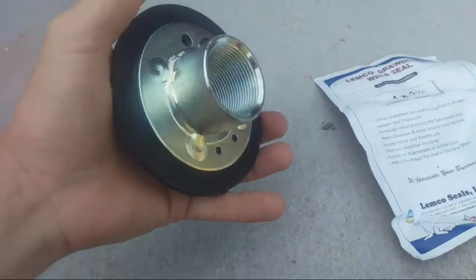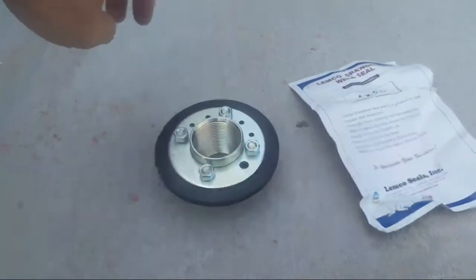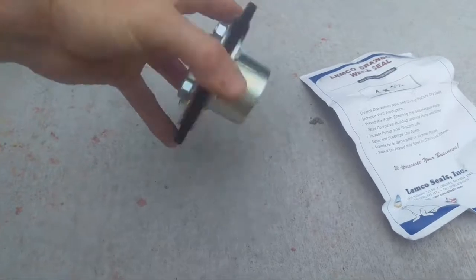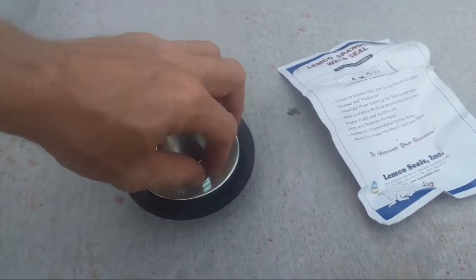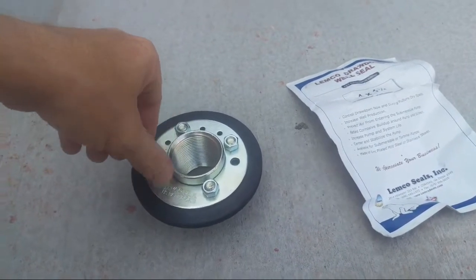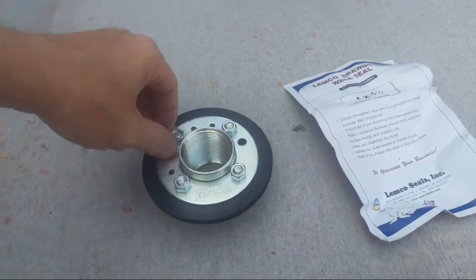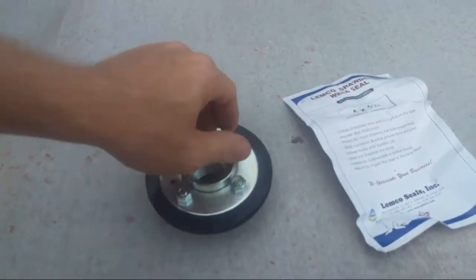But anyway, yeah, good luck with it, man, because they've worked for me in the past. I had a very similar well locally that was extremely bad, and the only way to prevent the pump from getting clogged was to put in the drawdown seal, preventing aeration, oxidation of the iron, and potential growth of all that stuff. So far it's been 3 years now, and the guy hasn't complained at all. I could probably pull that pump out of there and it'd be like brand new.